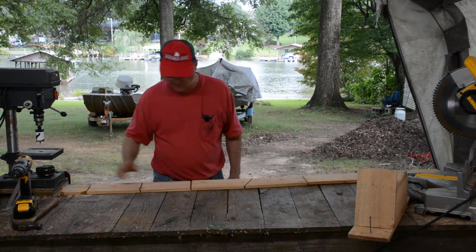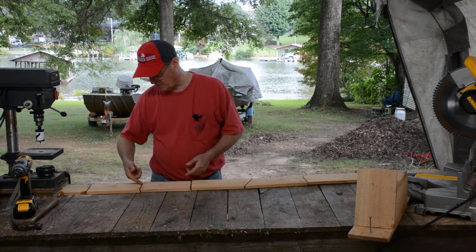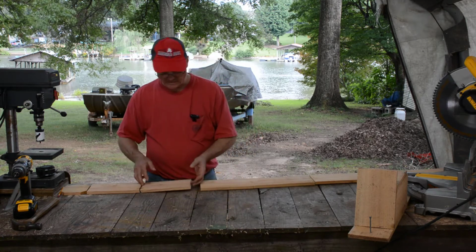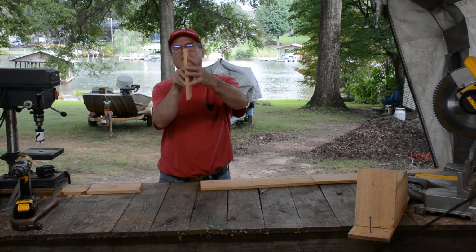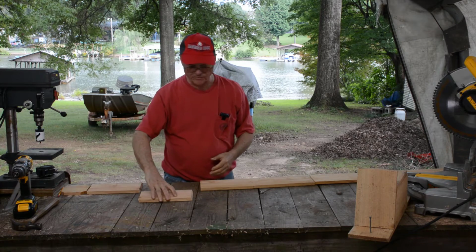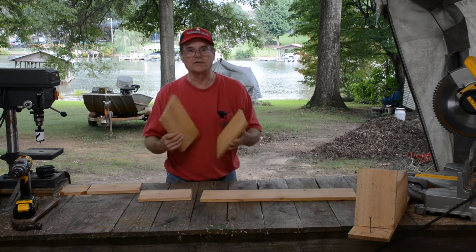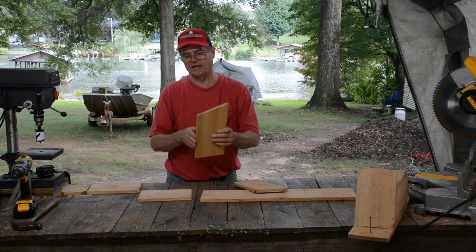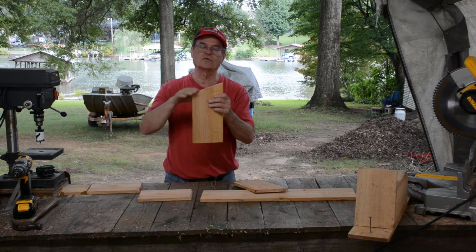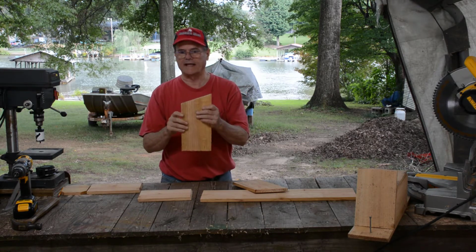Now, for some people, you don't know how to make a 20-degree angle. And this cut right here is a 20-degree angle. This one's a 20-degree angle. I don't know how much you can see that, but that's not cut straight off, it's cut at an angle. And if you have trouble figuring out how to do angles like that, once you cut these 2 pieces, this side will give you the measurements, this side will give you the measurements, you cut it straight off, that's a 20-degree angle. So you've already got something that's at that angle.